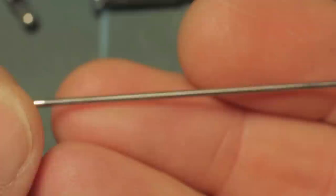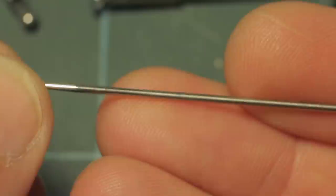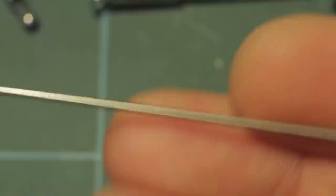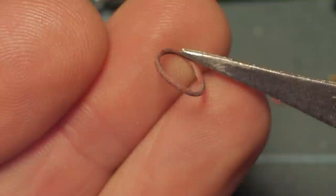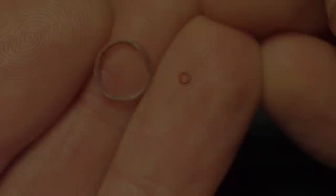The needle itself has some bits of dried paint in spots, which a simple quick wipe with cellulose thinners would have resolved. The paint cup seal, which I believe is made of Viton, is quite grubby — you can tell there's quite a bit of caked-on paint. These two seals should be similar colour, so you can see that one's got quite a bit of buildup.